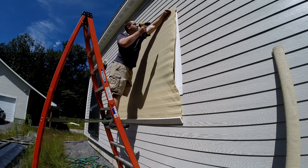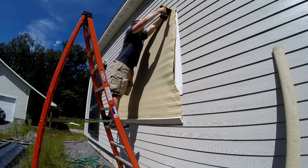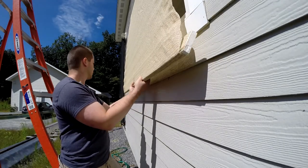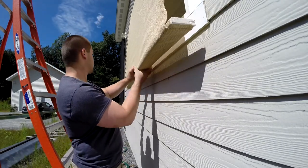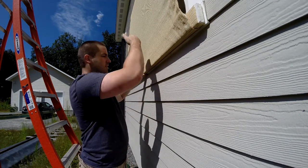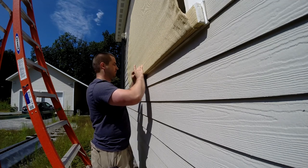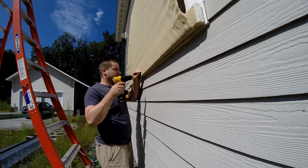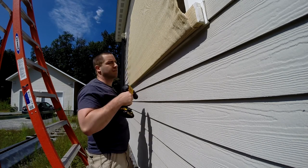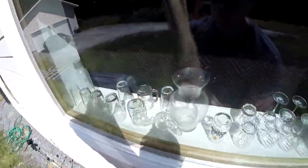The manufacturer said these reflect 85% of long-wave radiation, which is the heat energy. Inside the home we still get light coming in — they're not blackout — but we definitely don't get that sharp contrast light that turns into heat. I can tell we don't have to run the air conditioner most of the summer by having these, in conjunction with doing some thermal flushing at night, which just means opening the windows.